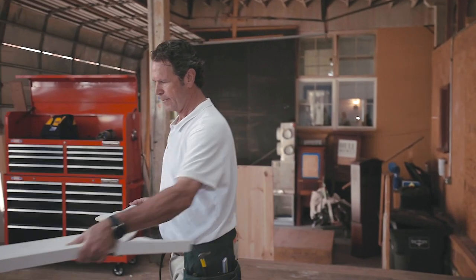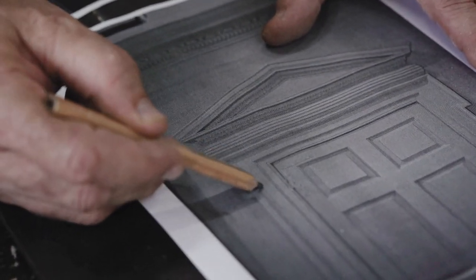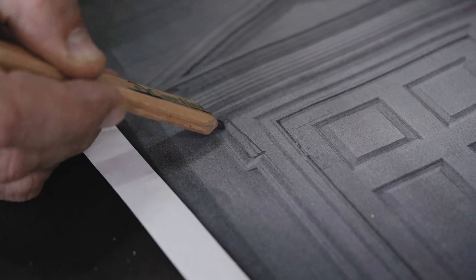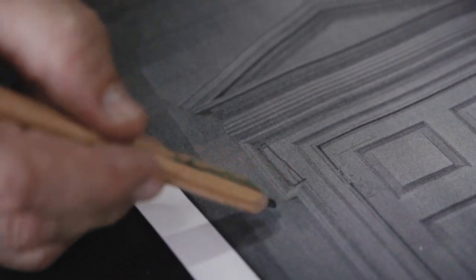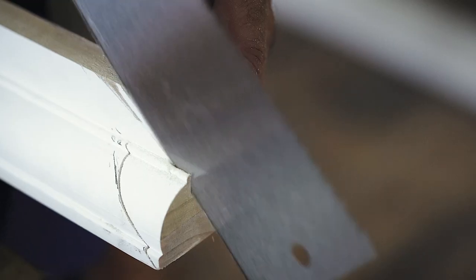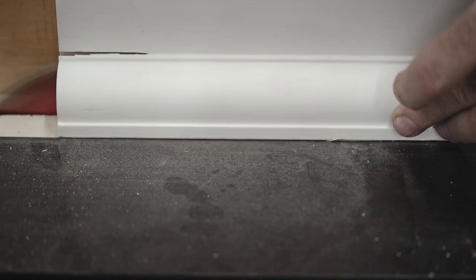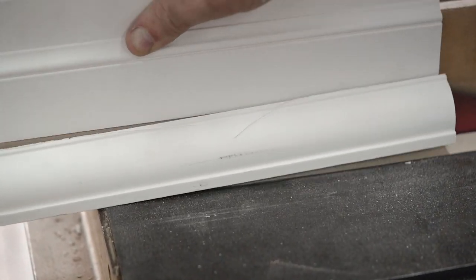Now, the other way to do it is inserting a block in here that kicks it out 1 inch, okay? Ish, maybe 1.5 inches. And it really doesn't take much to create this emphasis. It really doesn't require a lot of work in order to do this. In fact, this other kind of cross-headed corner where you're inserting this piece has to be made with a couple pieces of this casing, right? So I've already ripped down a piece of this casing on another piece. This is the result of that.